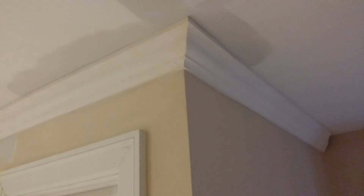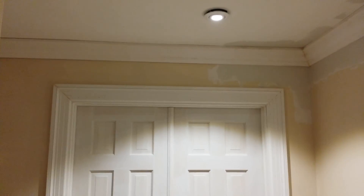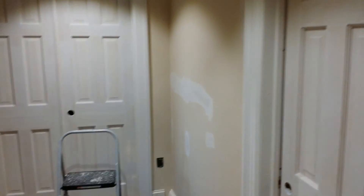As you can tell, the trim now fits perfectly all the way around. And when this is all dry, I'm going to have to do very little caulking — just a bead all the way around, top and bottom. That's pretty much it. The joints work out very well. It's just one extra step, but I also have to go through all the walls and fine tune, make sure there's no imperfections.